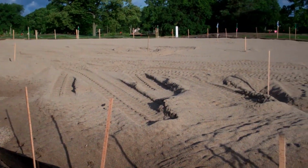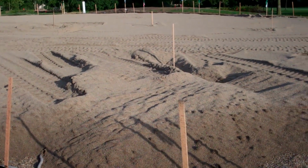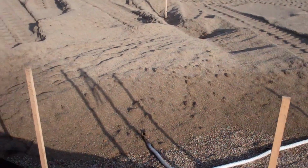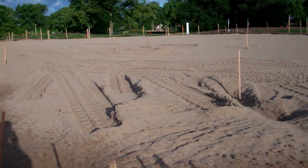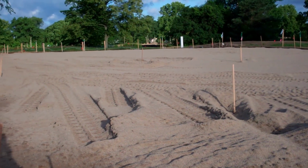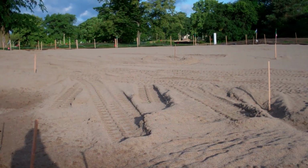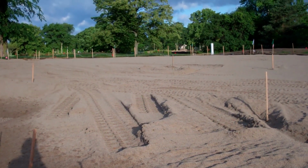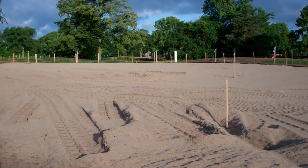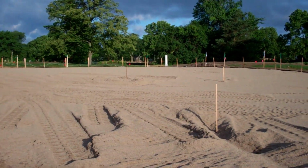There are about 6 things we're doing to enhance a typical USGA recommended root zone in a putting green. First thing we're doing is a variable depth, where areas that are prone to being droughty, near the surface, high areas, ridge lines, are dug slightly shallower, so it'll end up with, say, like a 10-inch deep root zone, 9 to 10 inch, and that just kind of feathers out as the ridge line mellows out.